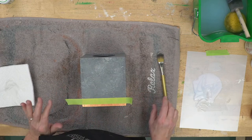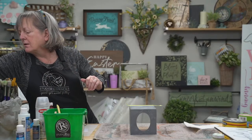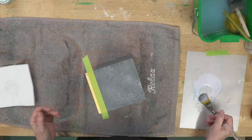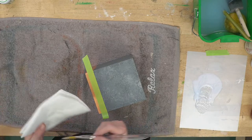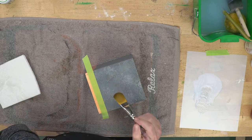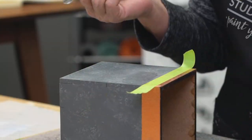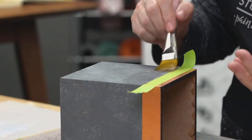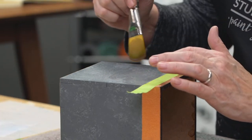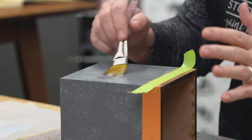Okay, so when are you going to get pulling? I'm going to get a dry brush, and what I'm going to do is pick up dry varnish. Pulling happens more on big projects, but I have a really hard time showing it because I've been muscle memorying this stuff forever, and I instinctively know that I'm not going to get pulls if I do this or that. But if you have dry stuff and you go back into your dry varnish, it's going to make a little streaky pull thing. You want to stay out of drying varnish.